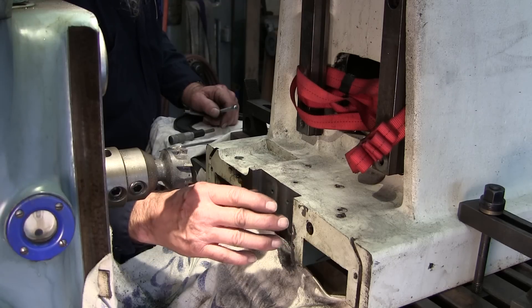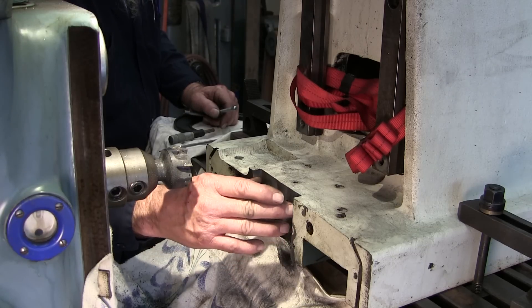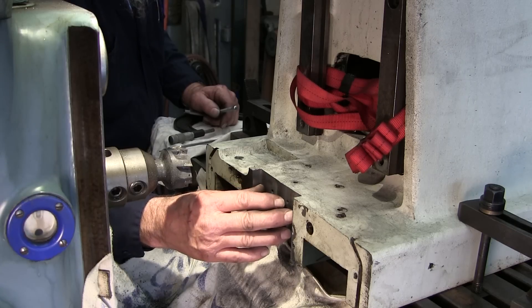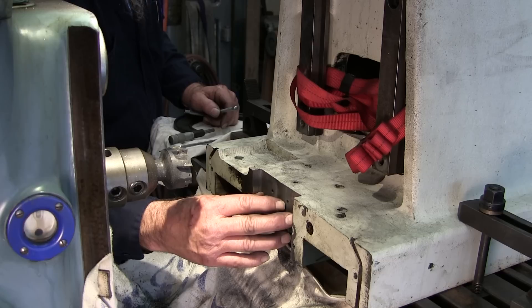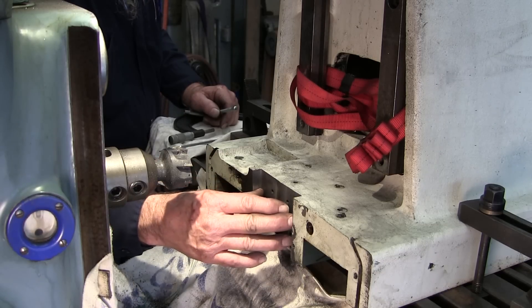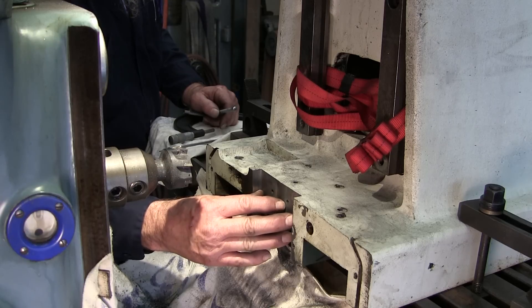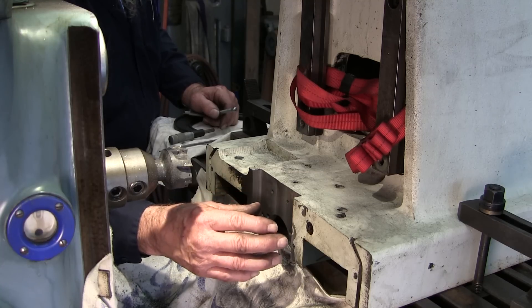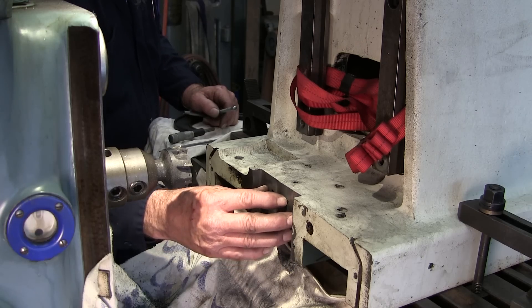We want to just minimize any of the side-to-side play so that the bolts and everything else anchor this thing down — there's no thrust on this thing, it's just up and down pull. There's a counterweight on the whole system so it hangs. And this nut is actually on the top of the spindle section, not on the bottom, so it's not like if you lost the counterweights you'd be hanging from this anyway — you're not supporting from underneath.